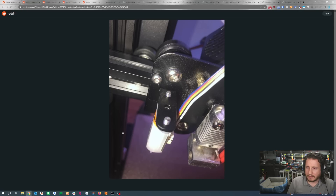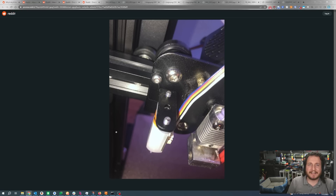That's a big issue because it means your nozzle is going to contact your build plate before the probe could even have a chance to trigger. I've installed these probes before, and I would hedge a bet that it's installed upside down. We can see the manual and the mount — yeah, it's upside down. The big thing to do here, assuming you have the right mount, is make sure that you flip the entire thing over. The probe is not close enough, and if that's the case, you could look at trying to print shims, but overall the mount's just upside down. It's a pretty easy fix — just take it out, flip it, put it back on. It doesn't take but a few minutes, and that will solve those problems.